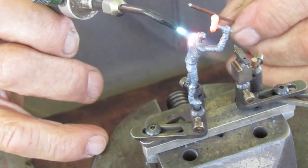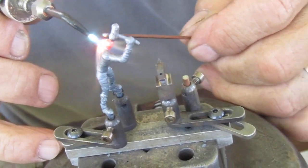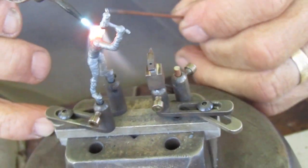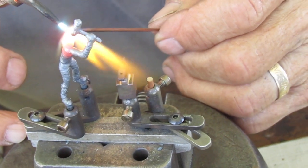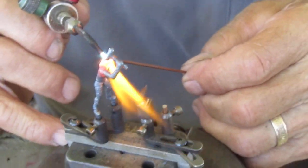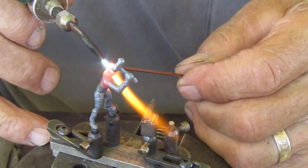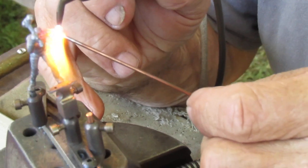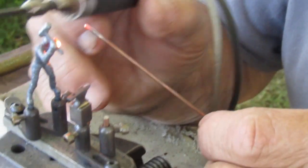Then I need the arm holding the work. So I go to the other shoulder and start building that arm out. Now I'm puddling down from the top down — it's a matter of finesse, controlling the molten steel puddle with the rod and the torch.